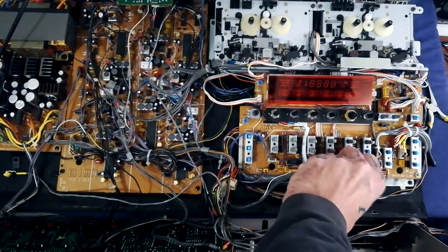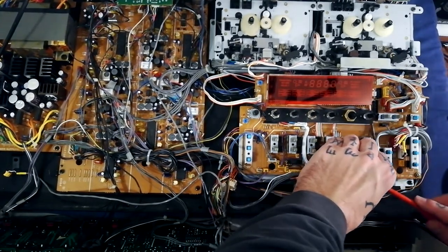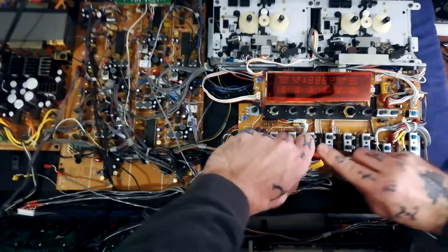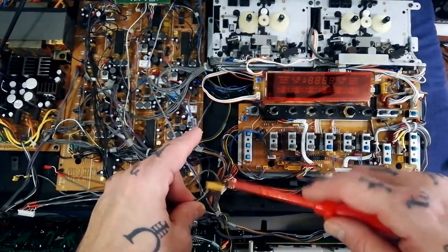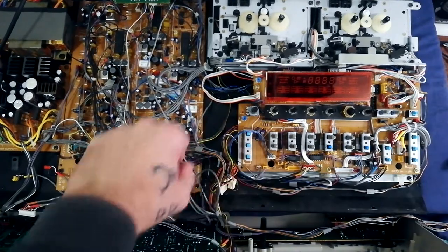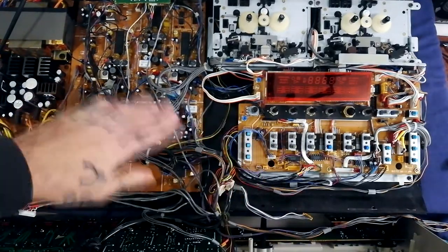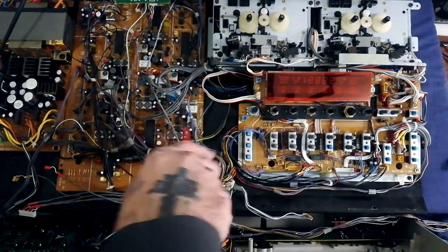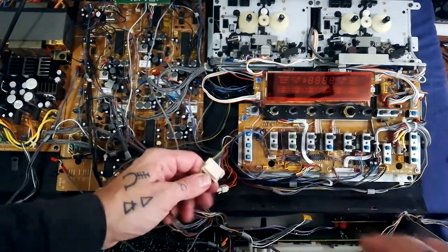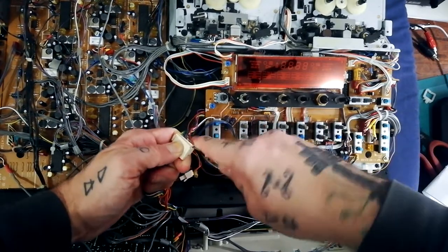There are two separate headers - a white one and a red one. Some of these signal cables look delicate so I'll pry those out carefully, perhaps using a flat head screwdriver under the lip. This yellow one is running to the mixer over here. For the purposes of reassembly, I'm hoping that the colour of the plug matching the socket, the length of the cable, and the number of pins in the plug will tell me what I need to know. This black one is running over to what must be the record/playback amplifier - you can see there are trim pots and variable coils, probably oscillation for the recording amplifiers. These midwire plugs are connecting the two halves of the unit; the best way to open these seems to be push down and then pry on the edge with a flat head screwdriver.